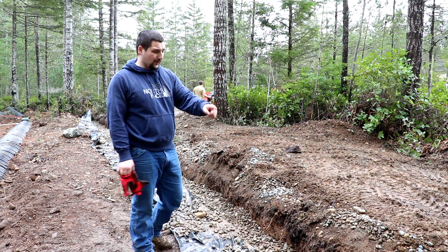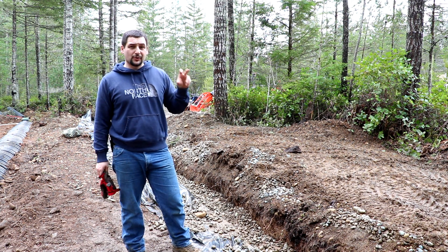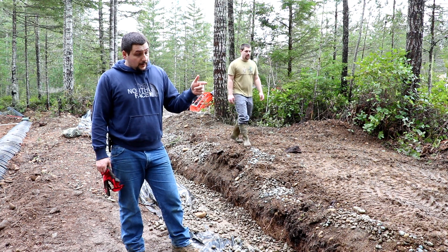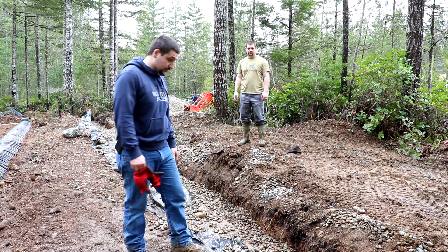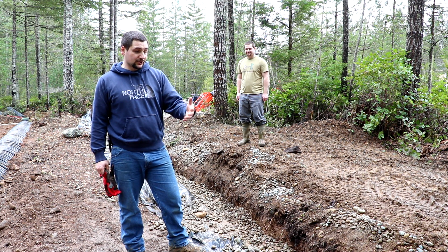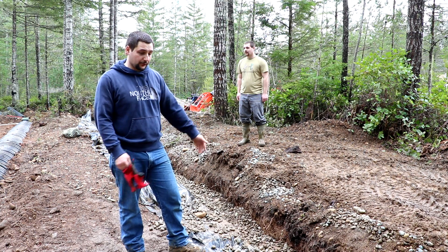The carry line goes all the way up to the house. We finished filling the trench up with gravel. This trench goes all the way down to hardpan and then six inches into the hardpan. This wraps up video number four for the septic system install. We covered the control panel wiring, making sure the floats were wired correctly, and also covered the test at the end before the septic inspector comes out and does the inspection. We will continue on with another couple of videos after this one. Please make sure you like and subscribe — it always helps me out with future videos. See you next time.